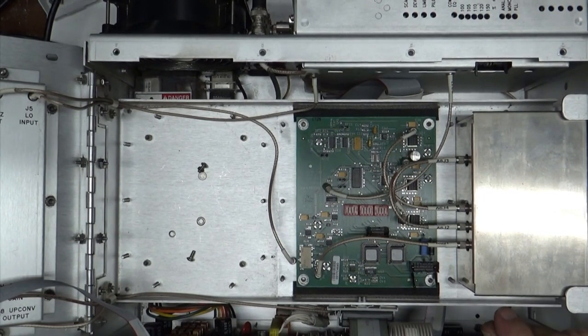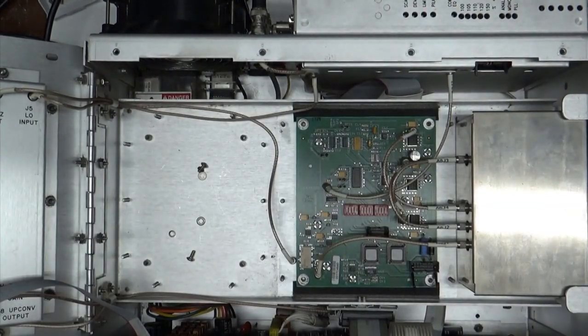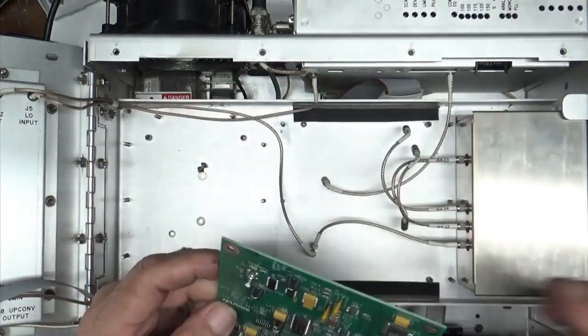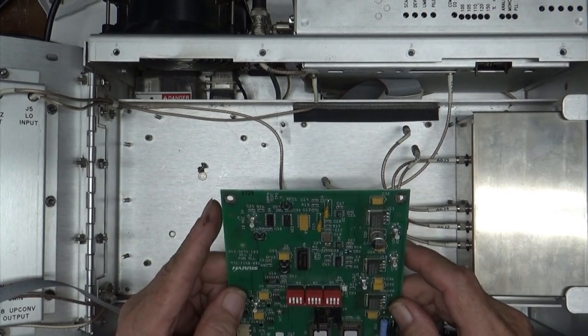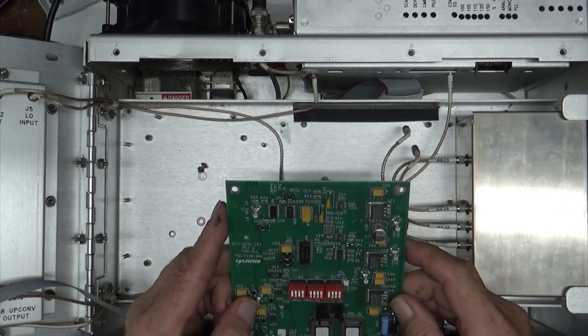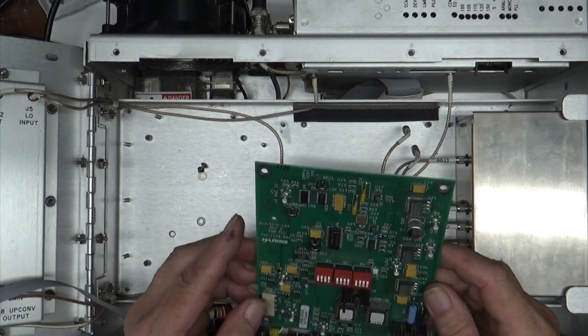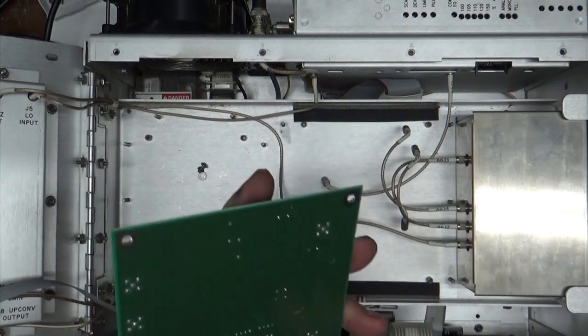And I said, you know, how about this? You measure your collector for voltages, and a lot of them went immediately to an oscilloscope. I said, measure the collector voltage and see what it is. And he says, okay. I said, what's feeding it? He says, well, it's 12 volts. Okay, that's good. What is it across that collector resistor up there? He says, nothing. It's not dropping anything, or very little. I said, what's it on your emitter? Go down to the emitter, and lo and behold, the emitter's about 10, 12 volts, maybe a little less. I said, what causes that?